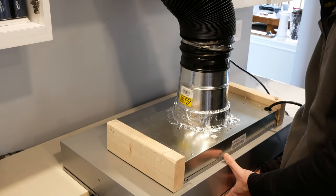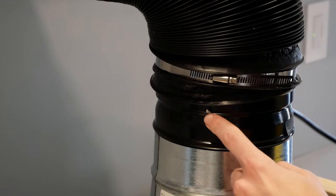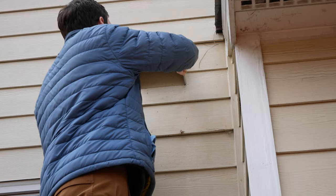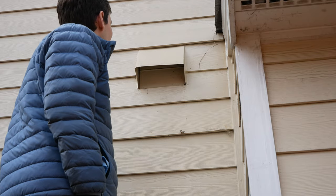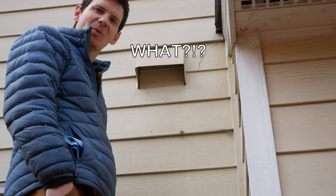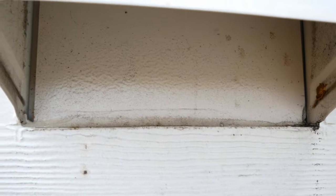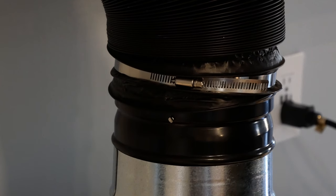It's not supposed to sound like that. The damper was opening and closing rapidly, which I thought was likely due to back pressure — I speculated I had some kind of blockage. Venturing outside to check the exterior vent where the duct exits the house, I found that at the top is the spring-loaded hinge where it's supposed to pivot, and at the bottom someone had caulked the thing shut. I cut it free and a bit of scraping later it's free to open as intended. Back inside, the damper is now working properly.